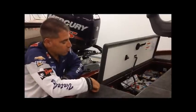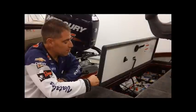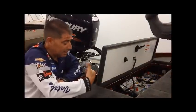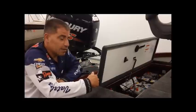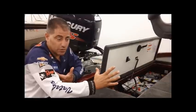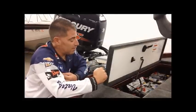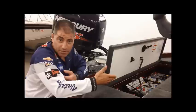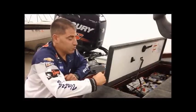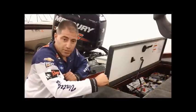And this switch that's in the corner of this boat is very, very important in today's day and age for these new boats. These motors require a lot of cranking amps to start. There's computers on them. They have to have power in order to start. And basically what has been going on is people are going out fishing all day on the trolling motor, not running their big motor much, because the big motor will charge the starting battery when it's running. And then all of a sudden they go to take off and their battery's dead, it won't start the motor. So you have choices of having a set of jumper cables, you have choices of bringing another extra battery or a jumper pack, but Ranger has kind of resolved that issue for you now.